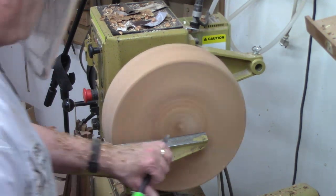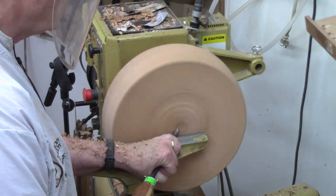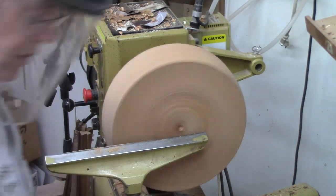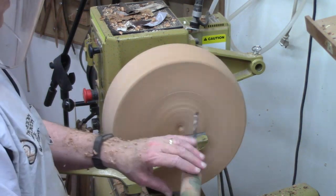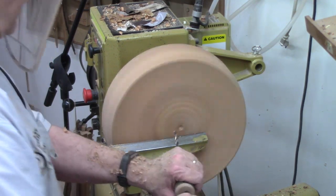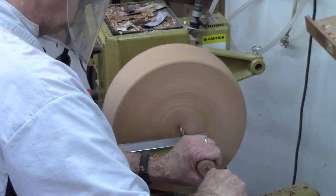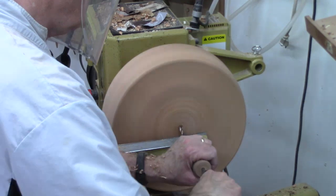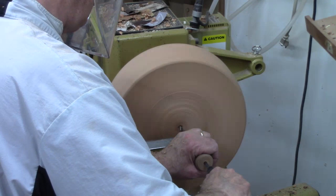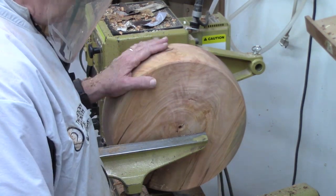Holding to my center to find my depth. Using a quarter inch depth drill — I've got it marked with a little washer here and a round handle to make it easier to hold on to. It's green wood, so I better clear chips periodically.